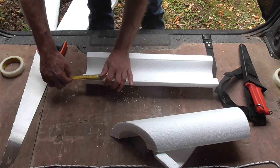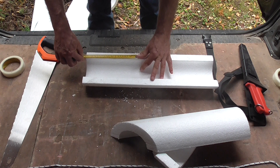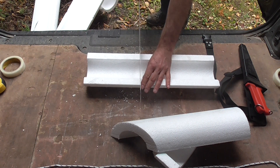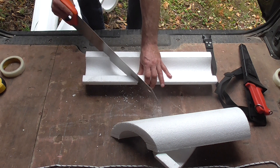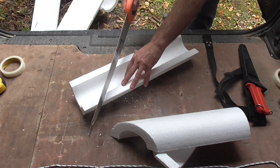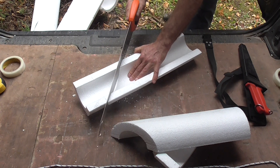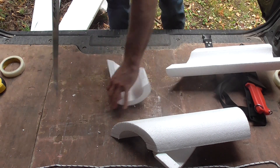So we've got 75mm, 150mm, and 75mm. And we cut across. You see, using the insulation saw there's little mess — best to use. And then likewise again on the other side, you just put straight across the marks you put in. And straight through this time — don't force the saw, take your time. Keeping your finger on the side of the saw will help keep the cut straight. So you just cut through. And we just take off the bit we don't require.